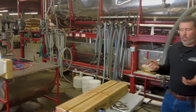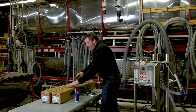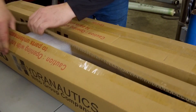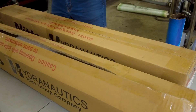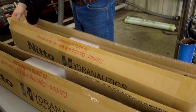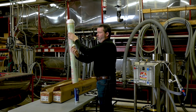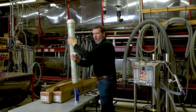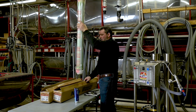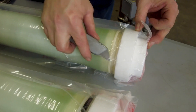Once you do, put those down, grab the membrane, take them out. Now the next step is we've got to open our membranes. I'm going to use a box cutter, but you want to be careful not to go too deep — just score the top of each box. They should pull right apart. Take those out of the box, and some of them there's going to be this little fitting in there. Those go to a different membrane housing, it's nothing that we need, so just discard that.